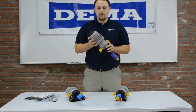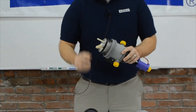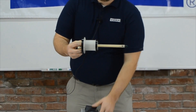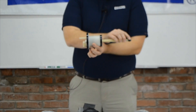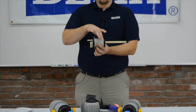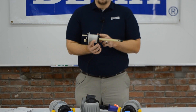The unit is very easy to maintain. One of our features is ease of replacement of what we call a lip seal. You simply take off the top of the unit, pull the engine out, and these black seals are the ones that are replaceable and tend to wear. This is an advantage over our competitors because you're able to pull off these seals and put new ones on. Where our competitors require you to buy a whole engine assembly, ours allows you to just change the lip seals — the actual wear parts on the item.